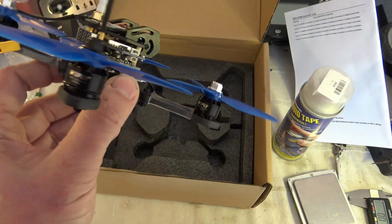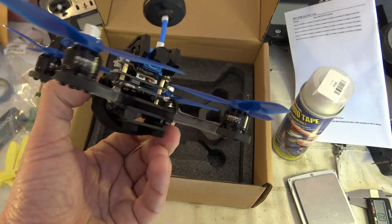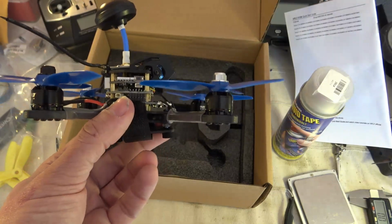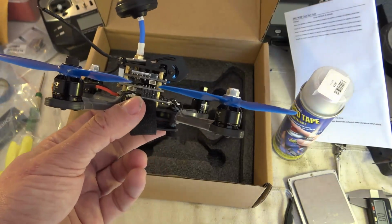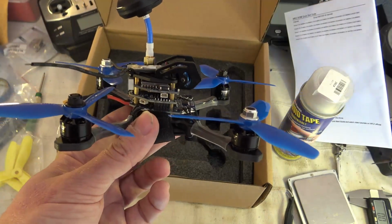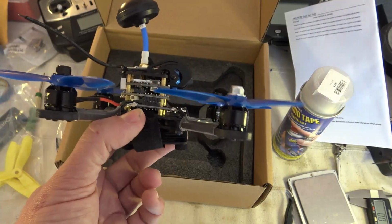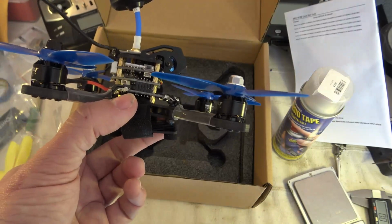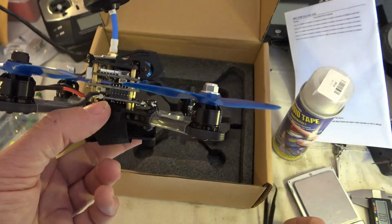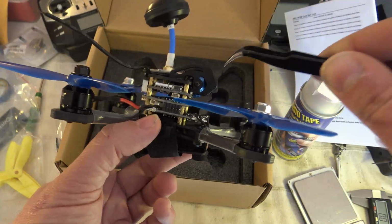I don't see if the gyro is soft mounted. It seems not, so you know that some MPU 6-axis stabilization chips are very sensitive to the speed, okay, at 8 kHz, and you can meet a lot of drift in angle mode, or some very weird behavior. That is definitely linked with the type of MPU used, and whether it's soft mounted or not. So here it seems not, so we will check that in practice, how it flies.